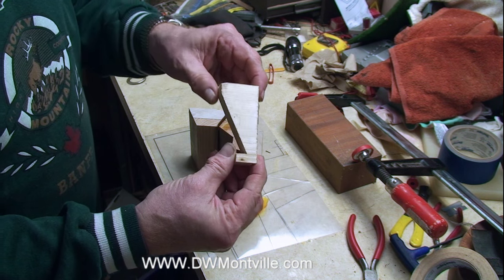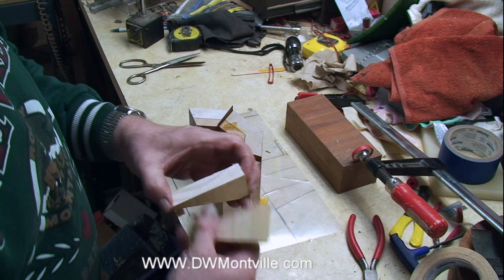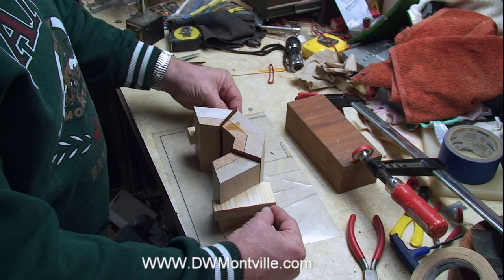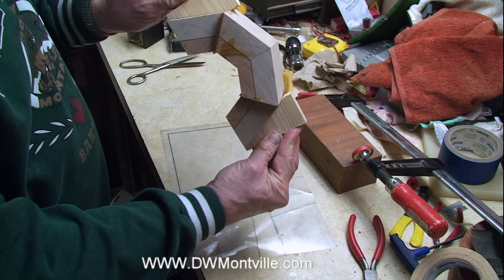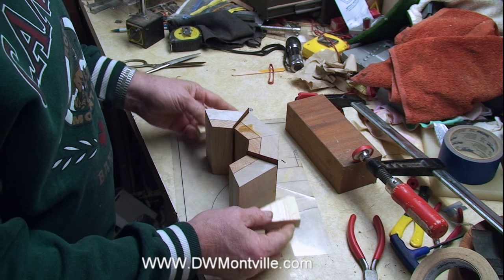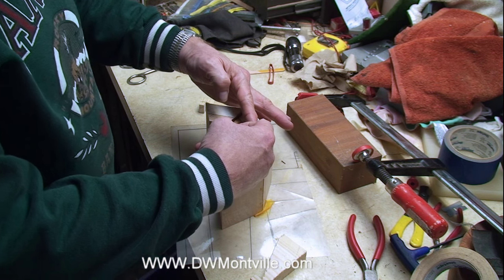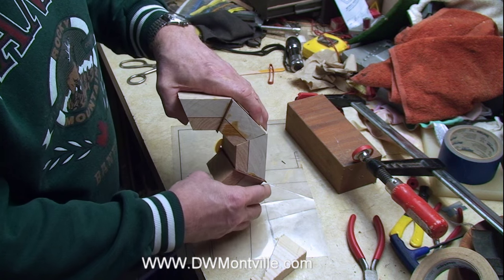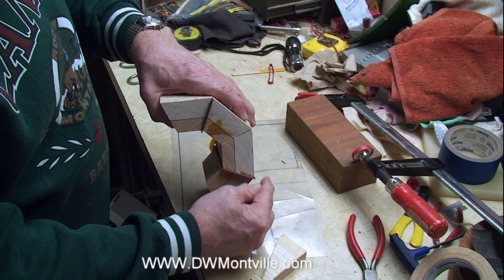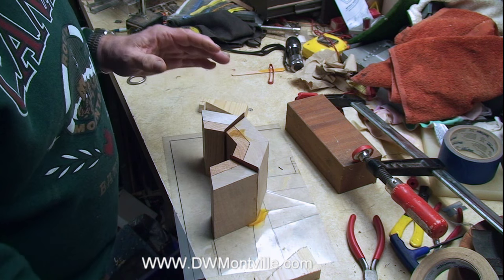As you can see, this is a fairly simple thing to cut on your bandsaw. You put one on each side, let it hook on the edge like this, put them down near the bottom, and now you've got a clamping surface to push on. As you can see, I can pick this right up holding it with just the pressure. The way you align this is when the pieces are together, you want to apply your clamping force as much towards the center as possible — imagine a straight line going through there, and that's where you want to put the clamp shoe.